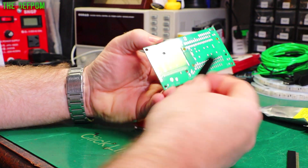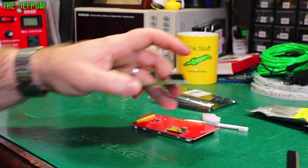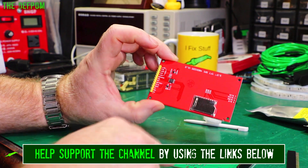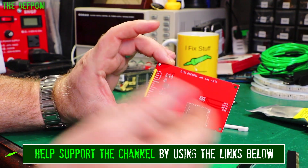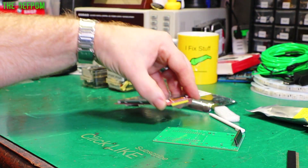I have a piece of female header here which I'll solder in place, and then the display will plug into that header. I also need to put some standoffs on the corners of the board — that's what it was designed for. So I've got standoffs to put in there to stand the board off so the display is mounted properly. Not a big deal, easy to do.